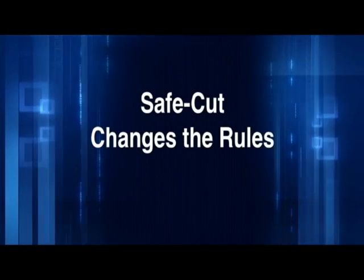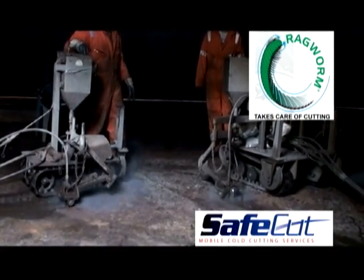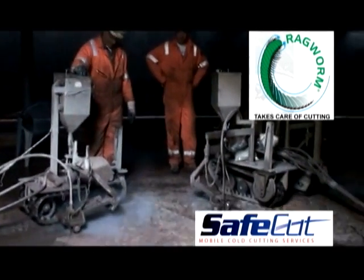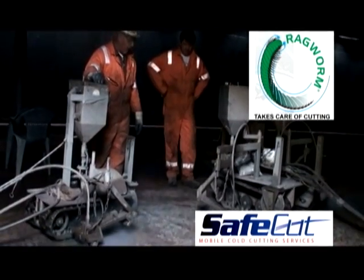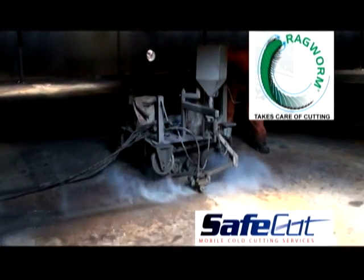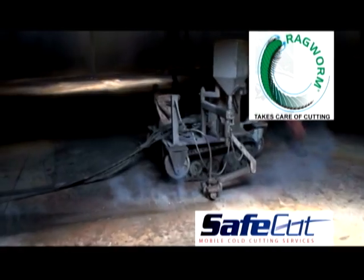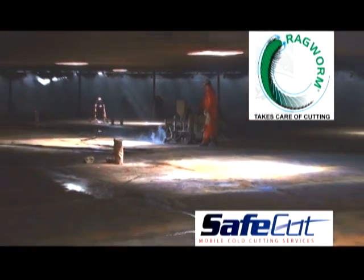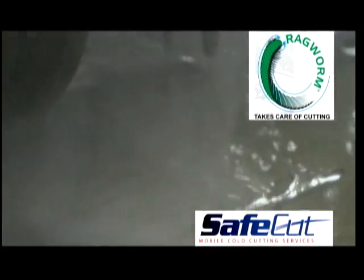SafeCut changes the rules. SafeCut's mobile cutters are highly automated. They feature single or dual cutters and can either cut straight or curved sections. The cutters, pumps, hoses and reels are all configured to facilitate rapid setup and rig down. The individual cutting nozzles can cut through quarter-inch plate at speeds up to 2.5 feet per minute in real-world working conditions. With a mobile cutter equipped with dual cutting nozzles, the system can churn out 5 feet per minute of cut plate. The mobile cutters are tracked and move under hydraulic power. They are fully steerable and bi-directional, meaning the systems spend less time getting lined up for a cut and more time doing real work. The produced cut is complete, clean and straight — not jagged, uneven and partially cut as handheld water jet cutters are prone to be.